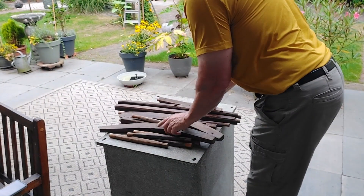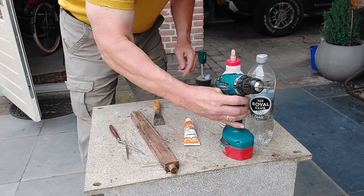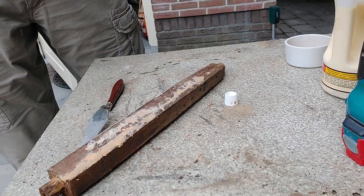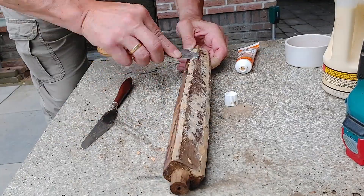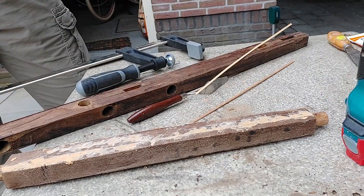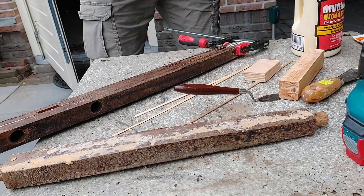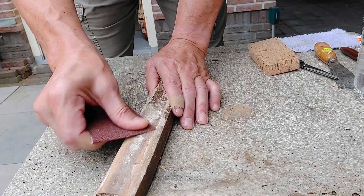There it is — there's your chair. It needed all kinds of work. Bad rotted pieces are drilled out, and I'm putting wood putty on there. I got a little bit the wrong color, so I had to come back and camouflage that. But there are lots of cracks and things, and I can put some wood glue in there and put some new wood, clamp it down. It'll be really strong and ready for the next hundred years.